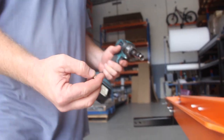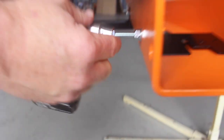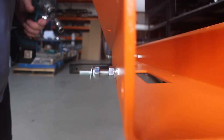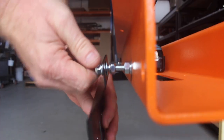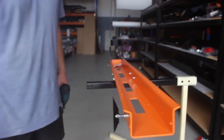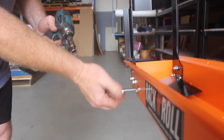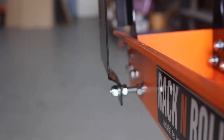Tighten that. In the light bracket bag there's also these. In the kit there's two nylocks and two washers. Spin the first one on about 15–20 mil, then put a washer, then put the bracket, the washer and the nut. Put it up the right way. The reason the lights bolt on is if you ever load a lower-clearance bike, you can grab it with your hand and just roll it down out of the way. Then when you've loaded the bike you can roll it back up. Same this end — nylock, washer, bracket, washer, nylock. Zap it up.